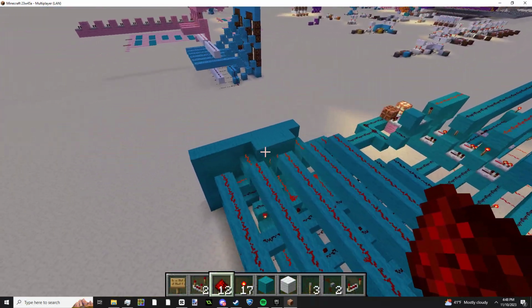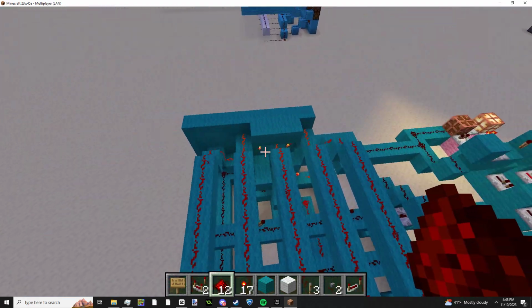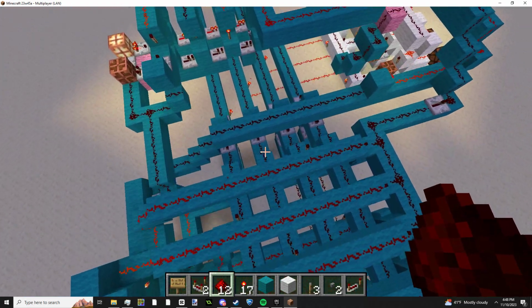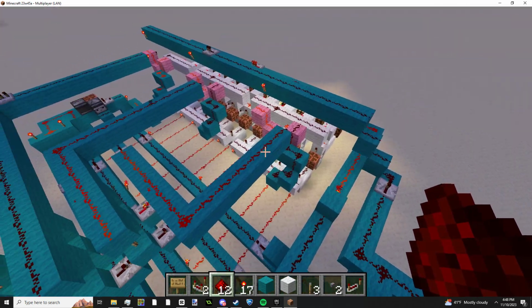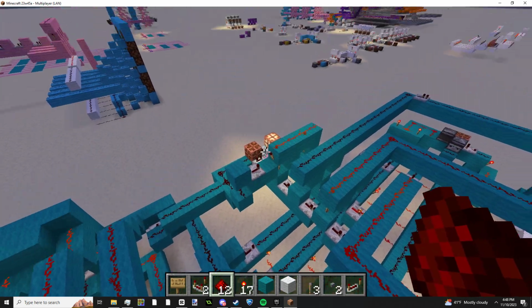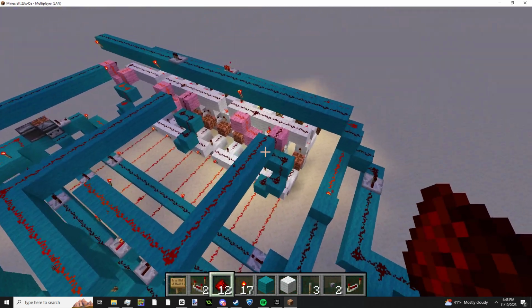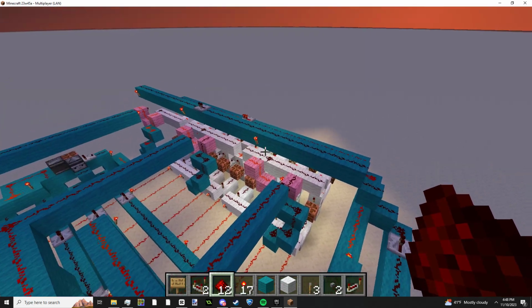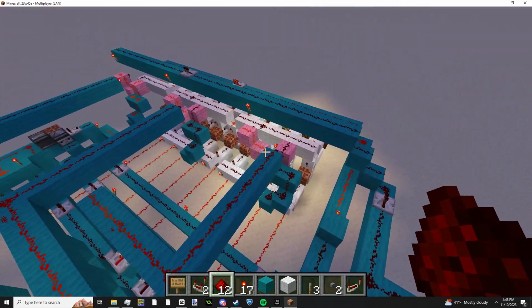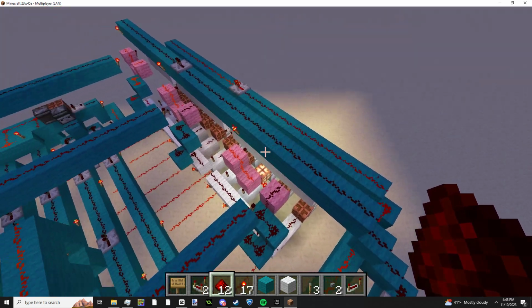We have a decoder for the inputs 1 through 9 that goes into a bus, and then it's put into memory cells. The memory cells are set to write whenever they're selected by the counter, which we have a button that shifts, and then it saves to that. Anytime this is pressed, we want to reset the cell that it's on. That way we don't have anything rewriting or inverting, so it will be safe.